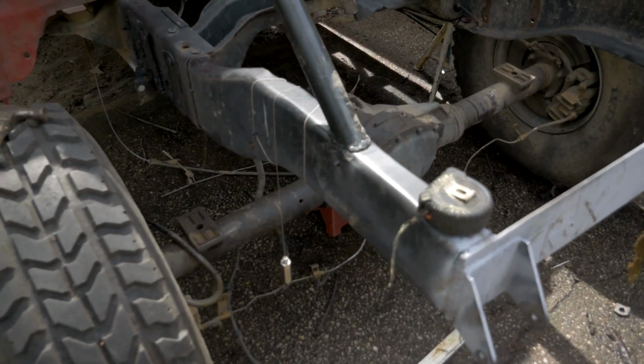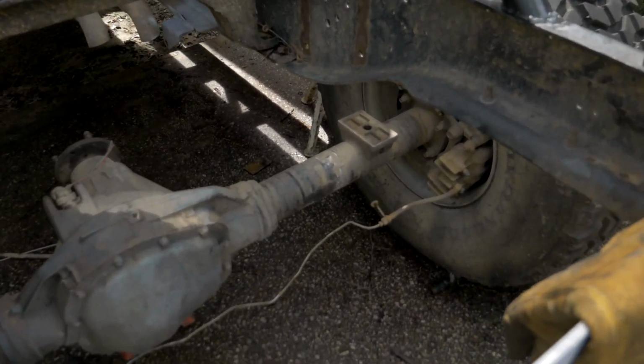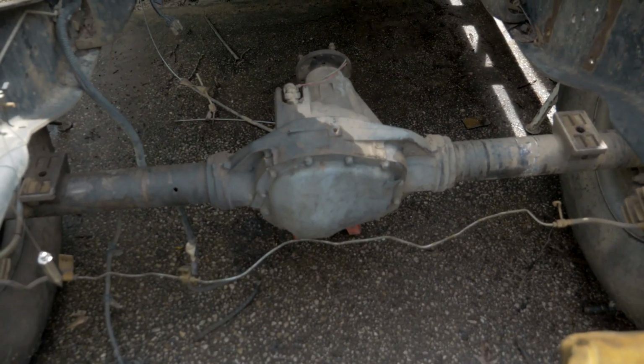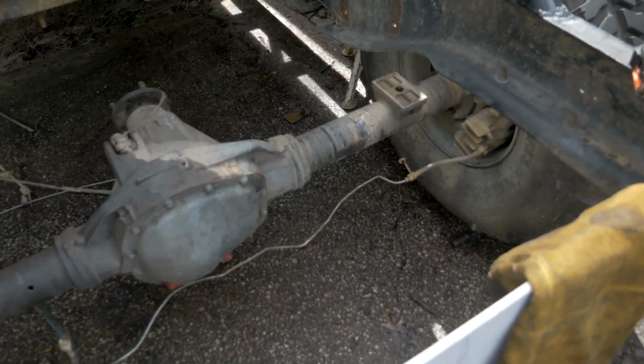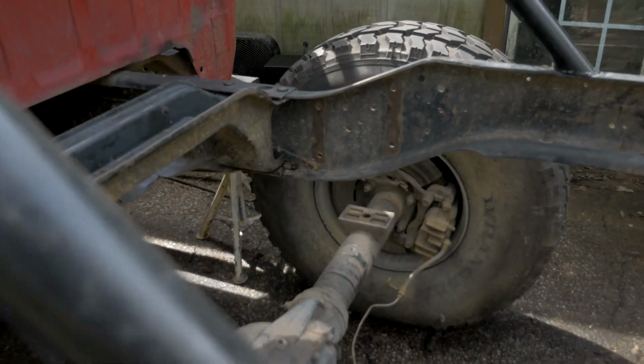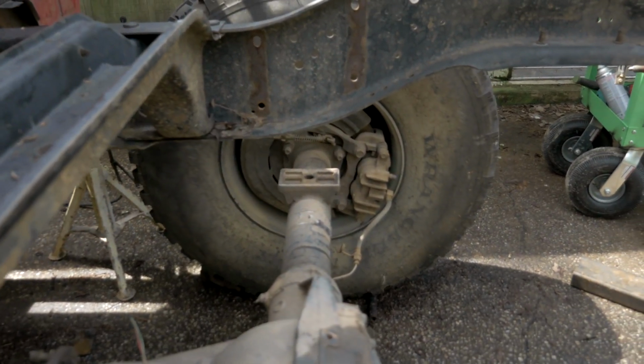The easiest part of this 4-link suspension is going to be putting on parts that I know are going to have a semi-permanent home throughout this whole process. And I'm going to start with putting on that truss in the middle of the axle, centering up in the middle of the axle, as well as tacking on my lower link mounts at the furthest point possible on the axle. As per putting them at the furthest point on the axle, that's strictly based off Jake from Busted Knuckle.